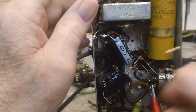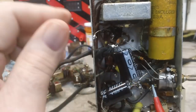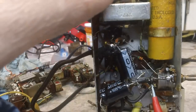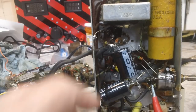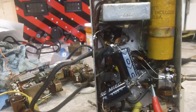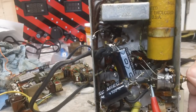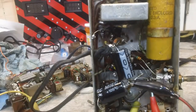I'm going to check this schematic over before I try to fire this thing up again. That just doesn't look right. It's been recapped, actually — not a great job, but it has been recapped. I guess they just left that in for aesthetics. If I do fire this up, I'm going to do it where I can get my hand on it real quick. It's smelling something now as it is. That says 1.6, 1.5 — that's actually a fairly decent figure there.